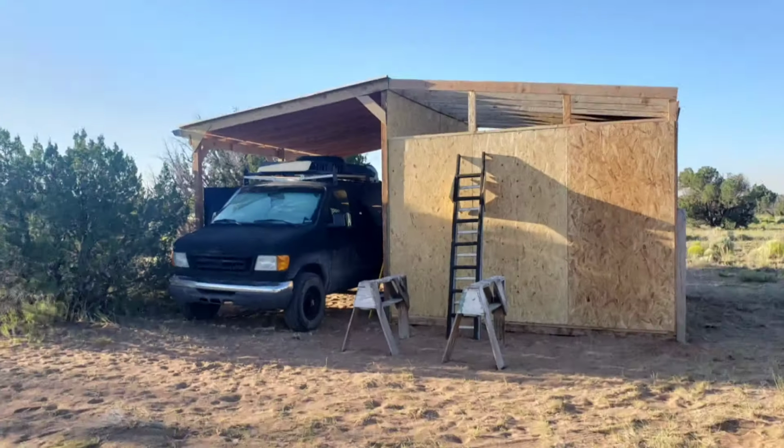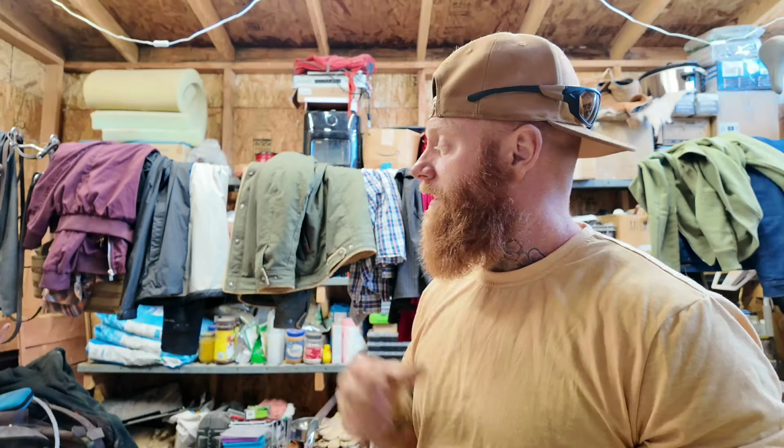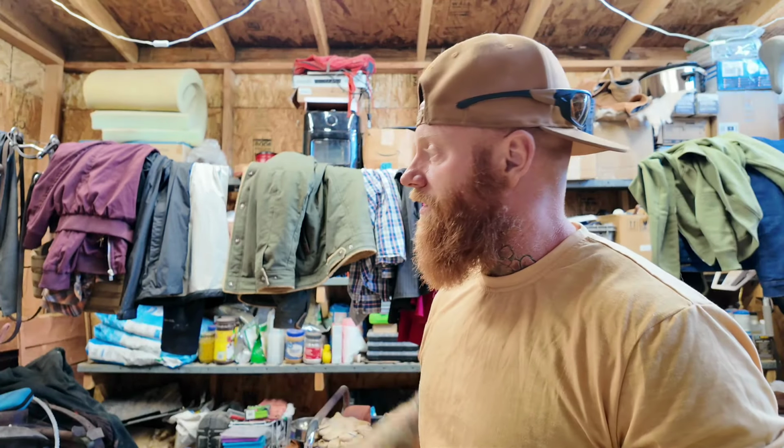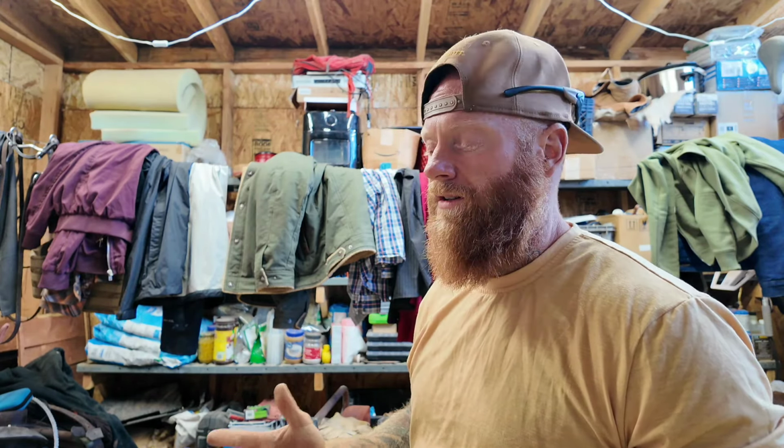And one battery here. You could get one 100 amp hour battery, a month later get another one. And it's not ideal. It's best to get maybe 8 batteries all at once, but you could, if this is what you had to do to get by. 1 battery this month, 1 battery next, but you'd be able to connect it immediately once you have your charge controller, your inverter, and 1 battery. You can start to add batteries. You can start to add panels. You know what I mean? It makes it more realistic for an off-grid person that's going to piece together a system.